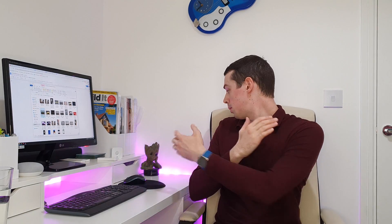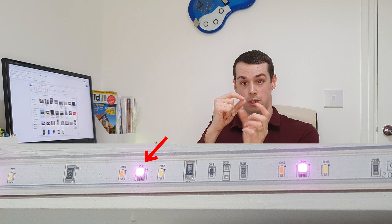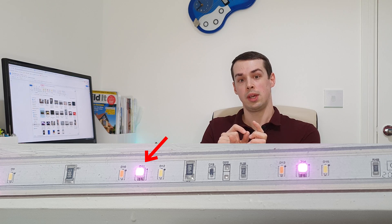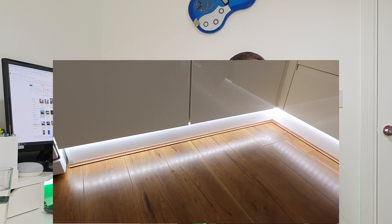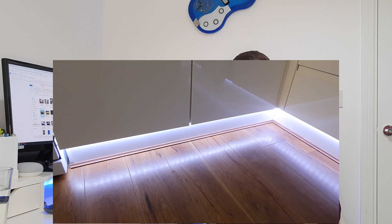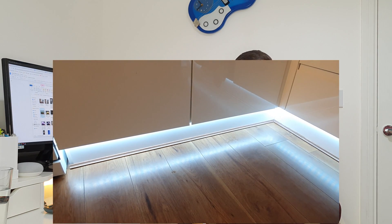When you go to a full-on blue, pink, or more extreme color, you've only got the RGB diode contributing, and possibly just one of red, green, or blue. So instead of five diodes effectively, you might just have one or two, and the brightness comes down. But I really like the color and brightness. What I really liked is that the color changes are really sharp and snappy — it's clearly pink, clearly orange, clearly blue. That's something I'm actually a bit disappointed with on my DIY strip, where color vibrancy isn't quite as good.